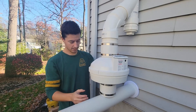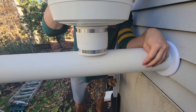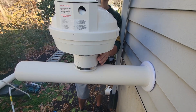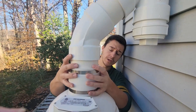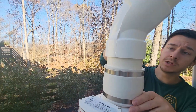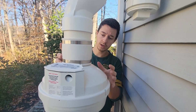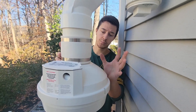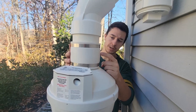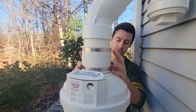We dry-fitted it. We're going to cut the piece here because it's too long, then put a 90-degree sweep adapter and connect it to the fan. For these pieces, we've been using about five-inch sections of PVC along this run, and we'll do the same at the bottom. These couplings are used to easily remove the fan if there's a problem or you need to replace it. You don't want to seal the fan into one piece because then you'd have to cut it all apart, which is a pain. That's what these couplings are for.